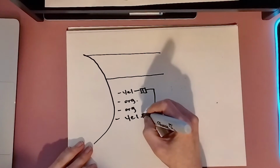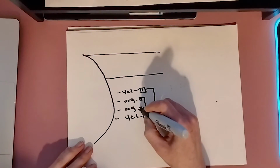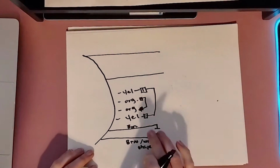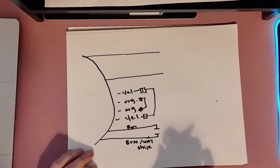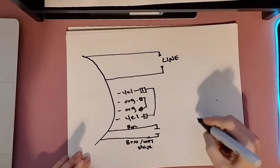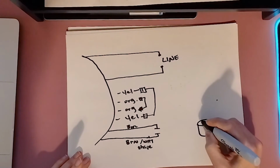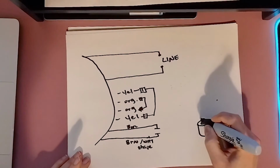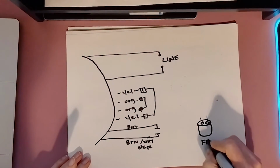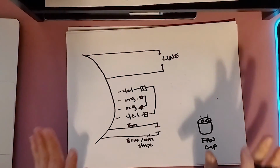Plugs that go down here. We've got these that go down here. Little boxy boys. Brown and white stripe. Okay. Most common, again, you can have 2 solid browns. Well, these 2 wires are conveniently placed here specifically for technicians to use that little small capacitor with 2 poles here. With these smaller fan caps, since there's only 2 poles, there's no polarity on that.